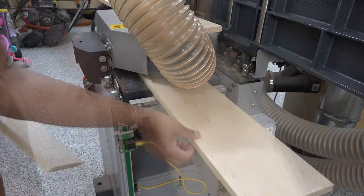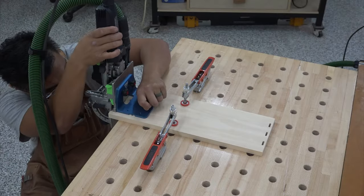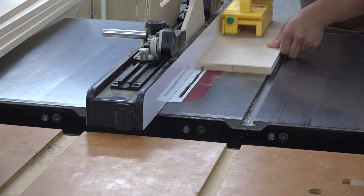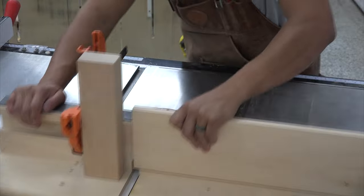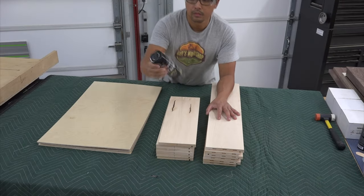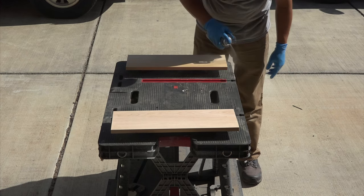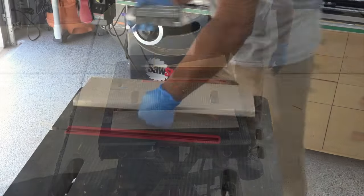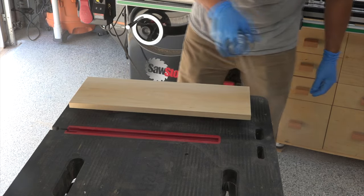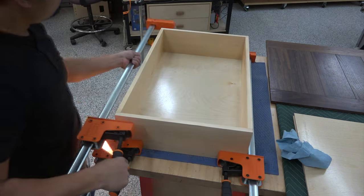Next I started working on the three drawers by milling basswood down to five eighths of an inch thick. Since I'm using undermount drawer slides the dimensions are dictated by the drawer opening and the fact that I'm using domino tenons for joinery. I added a groove to accept quarter inch UV finish plywood for the drawer bottoms and cut a notch at the bottom corners of the drawer back for the undermount drawer slides to slip through. I pre-finished the drawers with Minwax's spray lacquer for its quick dry time, easy application, and no need for sanding between coats. After sanding to 220 grit I sprayed a coat, waited approximately 30 minutes, and applied a second coat.